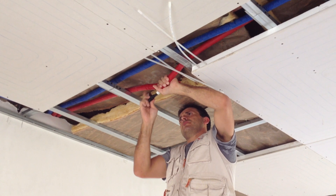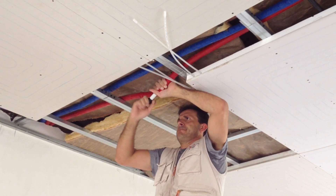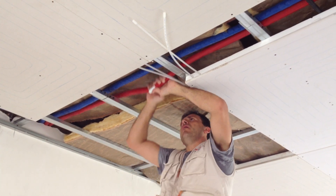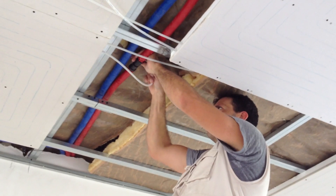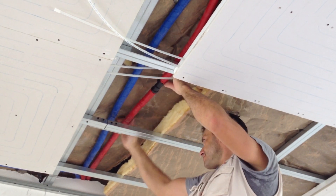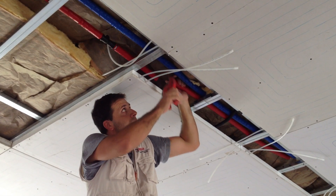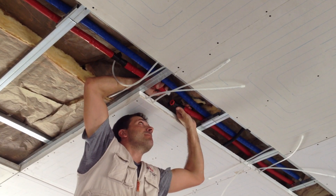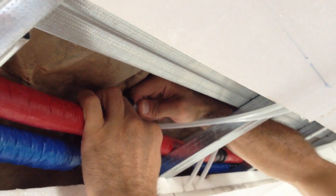With the calibrator, all pipes are widened so that the joints fit perfectly with the pipe. The technical features of this special joint allow connecting the pipes in an extremely safe way, without risk of leaks over time. The hydraulic circuit is made of a pipe of 8mm in PEX with anti-oxygen barrier. The same operation is made on the whole system, on each pipe, and on both distribution lines.